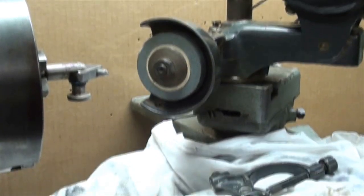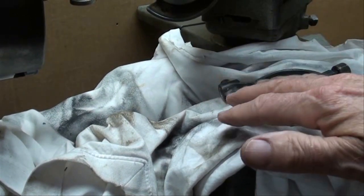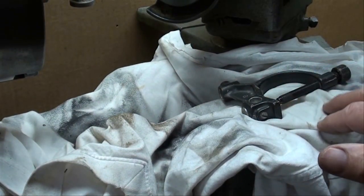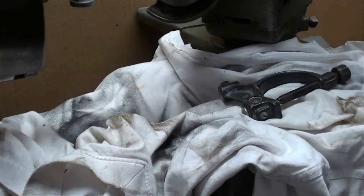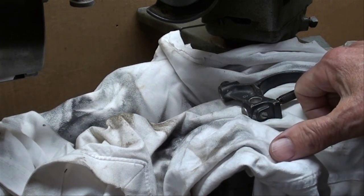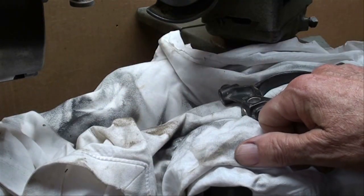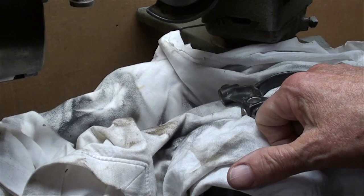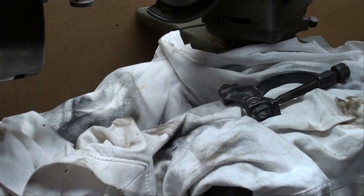You've got to note that there will be grinding dust and abrasive particles everywhere when you grind, so you absolutely have to protect your lathe bed with rags. When we're done, we're going to wash the entire area down and make sure we pick up all that grit. If you're doing heavy duty grinding, you may need to wet your rags because they can start on fire — or keep a can of water close. Please do not go to bed with a wet rag on there; oil the ways when you're done.